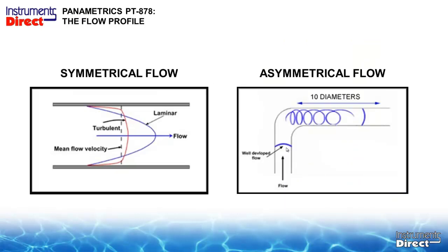All technologies require some straight run of pipe, and this is no different. For optimum performance you need a symmetrical flow profile, where the flow is fastest in the center and slowest near the pipe wall. This traditionally exists with 10 to 15 pipe diameters of straight run. For example, 10 diameters upstream and 5 diameters downstream to the next elbow. These different flow shapes are referred to as Reynolds numbers. What matters is that if you draw a centerline down the pipe, the top half of flow equals the bottom half. This is based on flow rates around 10 feet per second. Higher flow rates require more straight pipe; lower flow rates require less.